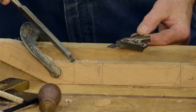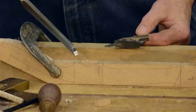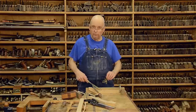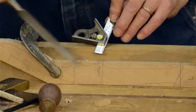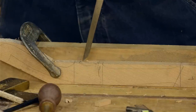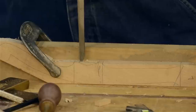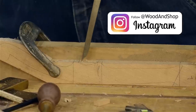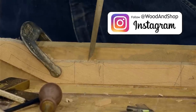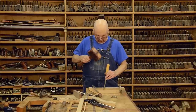Remember the mortise is going to have a curved shoulder - we're not taking that into account right now. We're just making the rough shape of the mortise at three quarters of an inch depth, and then later on we'll shape the curved part. I'm going to go back and forth, finish out this mortise, clean it up to final depth, then do that on the other arm as well. Then we'll have completed the joinery for the arms and can turn our attention to shaping.